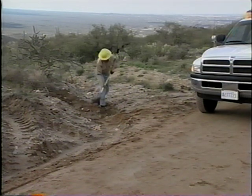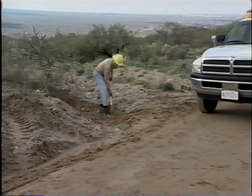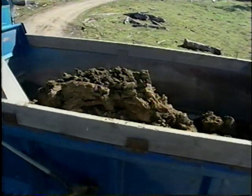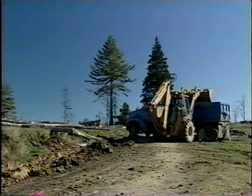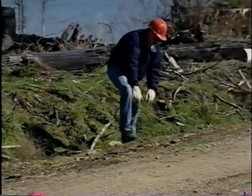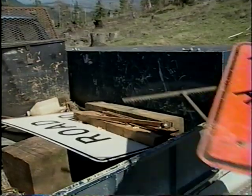When you've finished cleaning the ditch, use hand tools to clean any culvert inlets, lead-out ditches, or drain pipes. You're now ready to remove the accumulated debris from this section of the road's shoulder, usually with a loader and a dump truck. When you're working with a partner on the ground, be sure you know where that person is at all times. When loading into a dump truck, position the truck uphill from the loader — this will provide greater stability while loading. All collected debris must be taken to an approved disposal site. Replace any rip-rap or ditch dams you've removed. Check your work and remove your traffic control devices and safety signs.